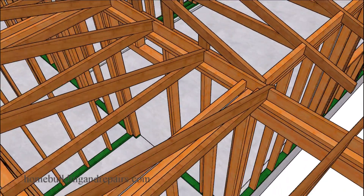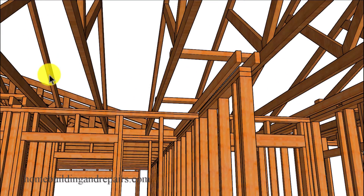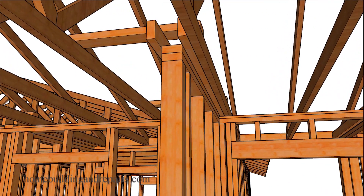Next up let's take a tour of the ceiling backing. The backing will usually attach to the roof trusses so that it will float with the roof trusses. The idea is that as you apply weight to the top of the roof — for example when adding shingles or roof tile — this causes the roof trusses to settle or move down. With that, you'll want the ceiling backing to move down also, so you're not going to want to drywall the interior without the roof being loaded or finished.